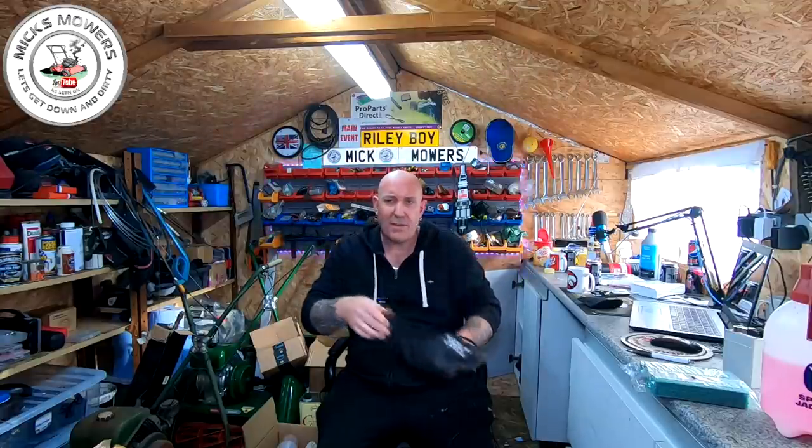And I think it's just quite well worn. So what I may do is have it in the upright position, and then I can adjust it up and down if I need to, but the forwards and backwards motion, I'm probably going to leave that and just put it all the way back and then put a couple of spot welds over it. So if I do sell it on in years to come, then they can just grind them spot welds off and they can adjust it for their height. They may have a little bit shorter leg, but I'd be right all the way back and as far down as possible so that way I can fit underneath the machine.